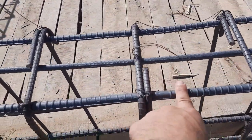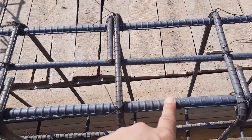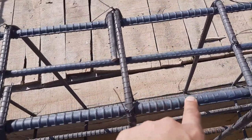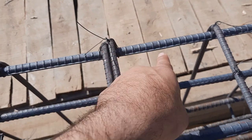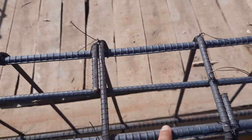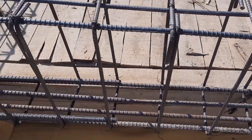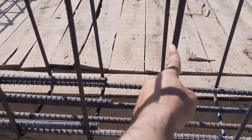In the compression zone, we have three steel rods which diameter is 16 millimeter. These two side steel rods are 14 millimeter diameter, and at the middle you can see this one is 12 millimeter. So these are the steel rods.